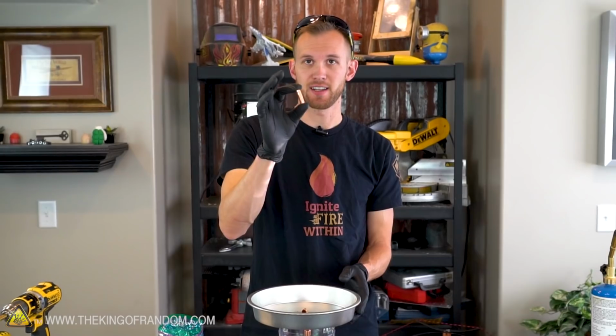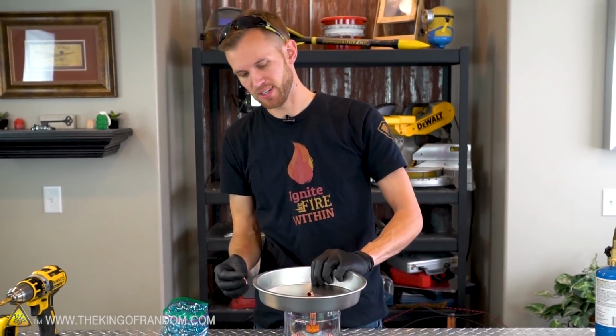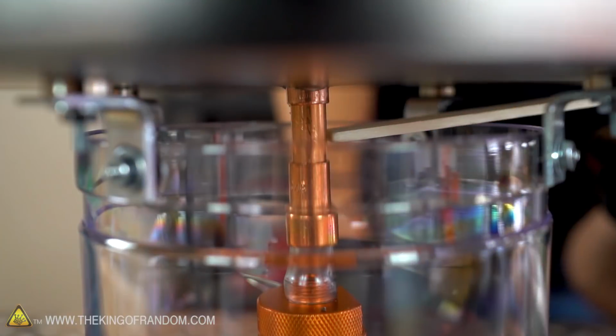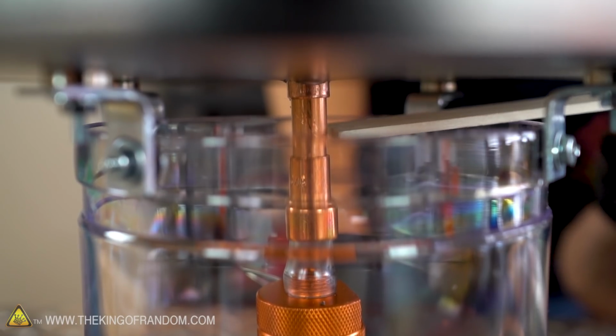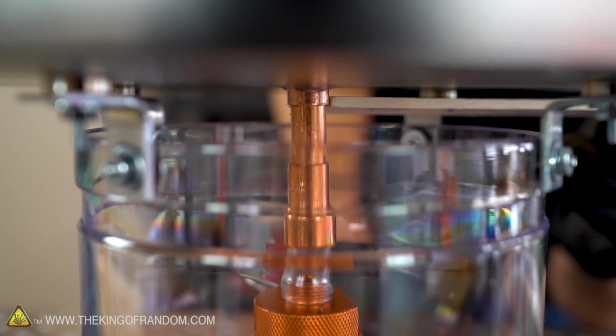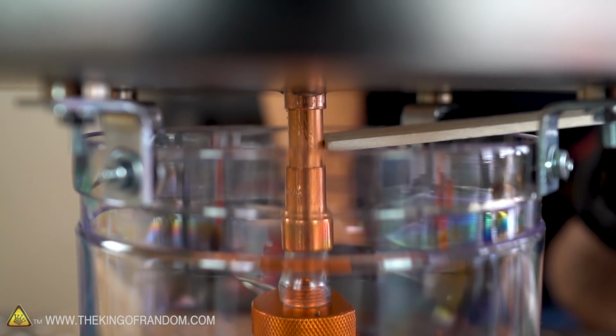I'm gonna do a little test. I cut this 1-inch piece to connect our elbow into our circle. I'm gonna see if that's close to the right size to connect these other 2 pieces. This length of pipe does seem to be working, but this particular piece of pipe is only barely inside this connection point. So I'm going to measure this piece's length and then cut another piece that's about 1/4 inch longer.